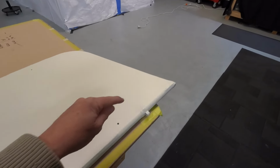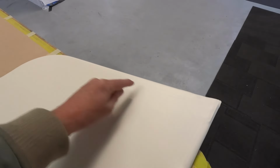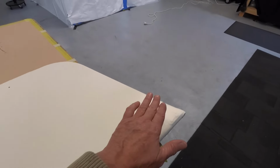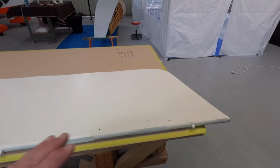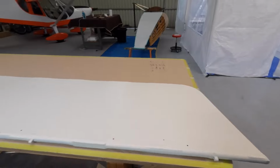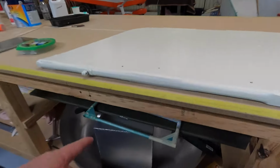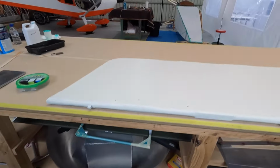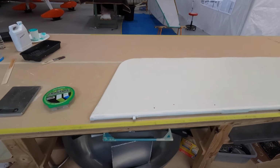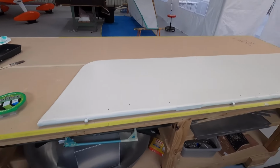You'll see as I go, but we'll lay the masking tape down, then I'm going to come back with the linen colour and just brush the edges all the way along. So it actually seals the edge, makes the tape react to moisture, and any little bleeds you won't see. And that's what I've done on my test pieces down under the bench there, and it's worked really well with little effort. So let's give that a go.